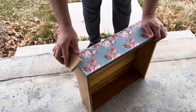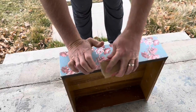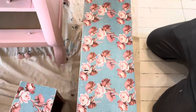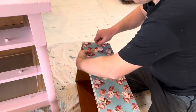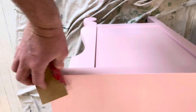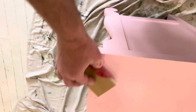We're just going to sand it and give it kind of an aged wallpaper look, and then we'll put one more coat of sealer over the top. We carefully put the screw from behind because the paper was still intact, and we're screwing on the pink knobs. Zeb, how do you feel about the paint finish so far? I think it would have looked great in Odelia and Eliza's room — I actually think it's pretty cool. Just some light little distresses right here along the edge, probably not even going to bring much out — just want to make it uniform with those drawers that have some distress, and then we're done.